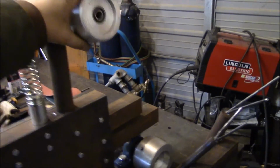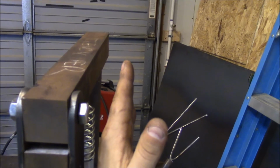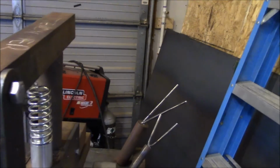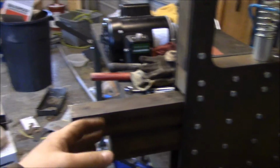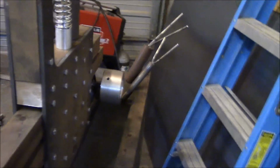And on the end here, we will have the tension/tracking wheel. That'll be adjustable a little bit like this, and that'll adjust how your belt will track. And then off of that, I'm yet to cut, for my tool, eventually one of these tools will be a 10-inch platen. So yet to do that as well.